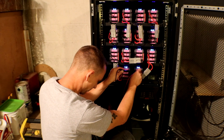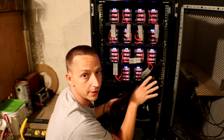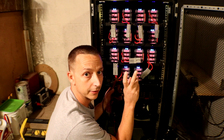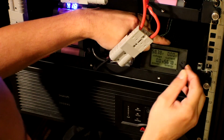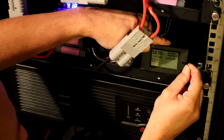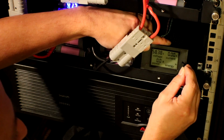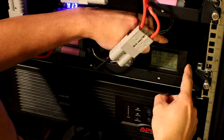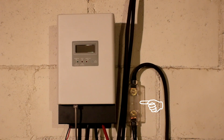The little meter says 58.38, my meter says 57.8. I'm not normally charging that high but for the load test I recharged it high just to get a more accurate count. I'll reset the energy meter by holding it down for three to four seconds until it says clear, then push it again to clear it. On the wall I removed the fuse from the solar so I will not get any power coming in until we are completely dead.